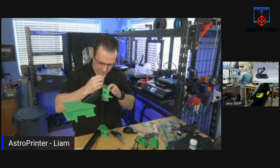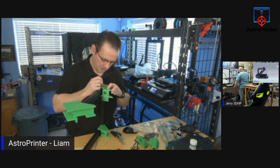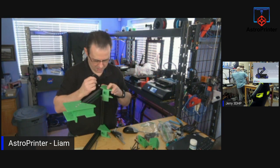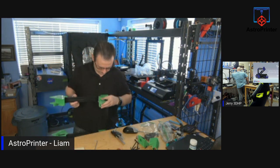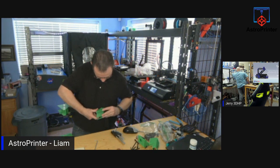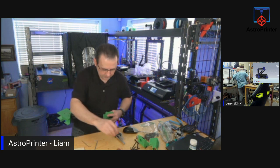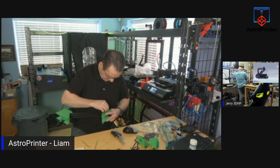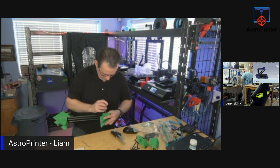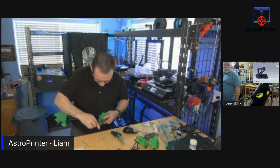Remember I switched out filament earlier, the PETG on the part for that belt printer? My extruder all of a sudden started clicking on me. I'm trying to help hand feed it to get past the clicking. I don't know why it was clicking, but it might be temperature. Yeah, I'm printing at 250. But do both materials print at the same temperature? PETG is not PETG is not PETG. It's saying 230 to 250 on this other spool when I swapped it out. I normally do PETG around 240. That's crazy. Different materials, because of the additives, can print at different temperatures.